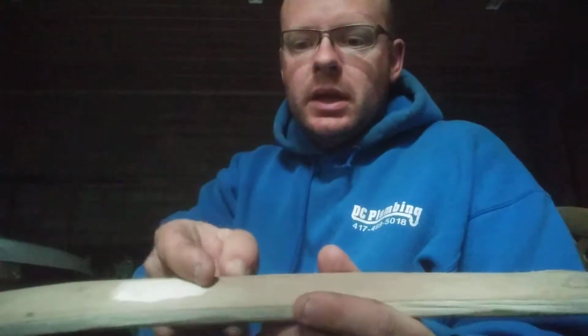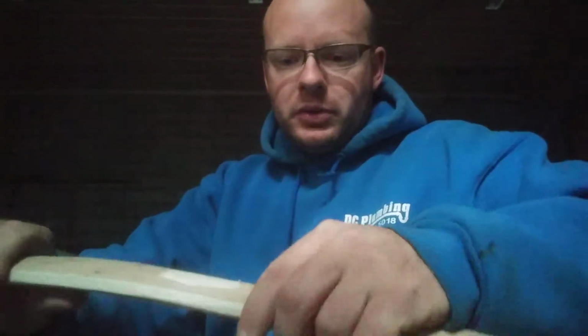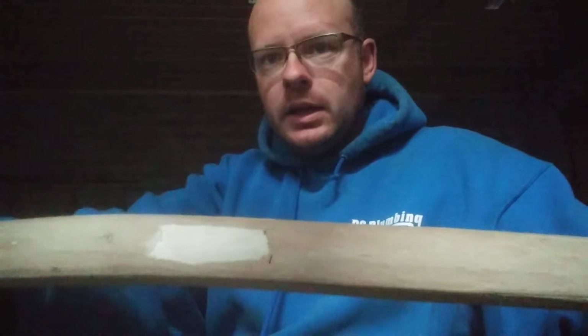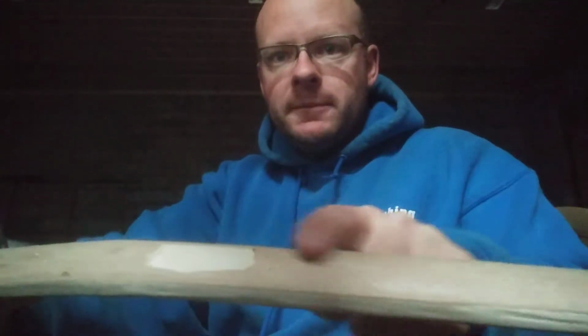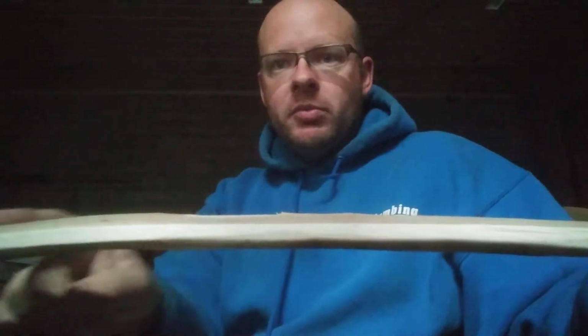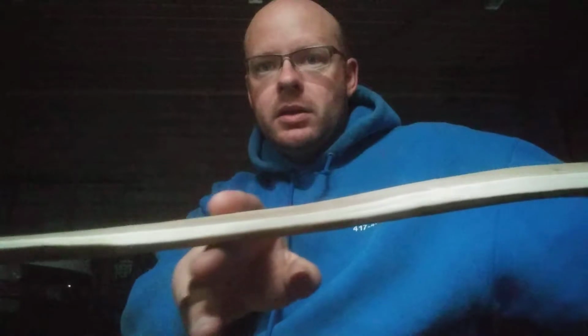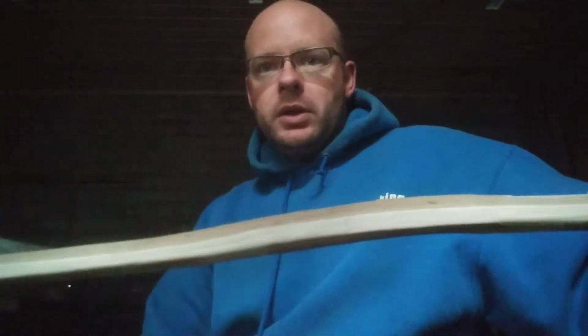So this is where that lower layer or underlayer of bark has just dried and is chipping and will peel back. Because you can see it flexes a little bit more right here, which is also a little thick right there. I'll compensate for that before this little kind of curve or wowie in the bow. But it's a nice bow, and it's about 45 pounds right now. And this is also the longest bow I have. It's actually just a hair over 5 foot.